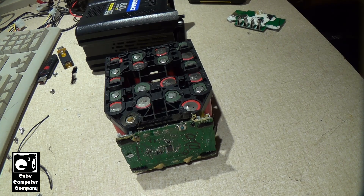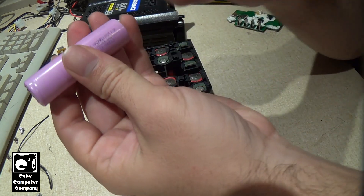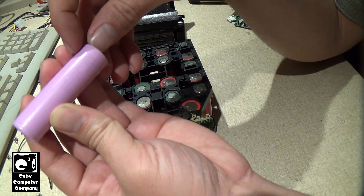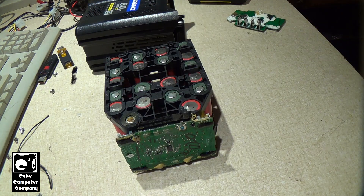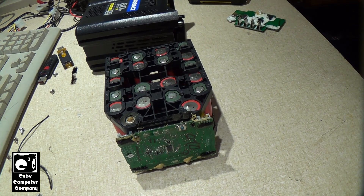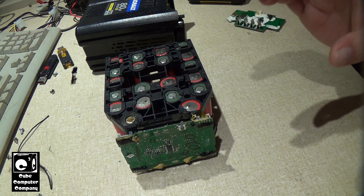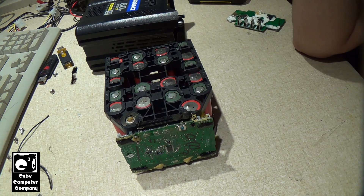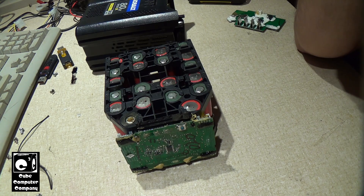For example, one of my Samsung cells I use on my outdoor cameras is an INR 35E — again, the safer chemistry. Some of the cells I run for cameras and flashlights are ICR or lithium cobalt, but I run those as basically one cell in series — 1S in most cases. The camera I'm filming with right now is actually 2S, but I'm using the original protection circuit from the original battery pack to protect those cells.